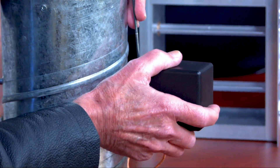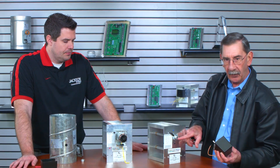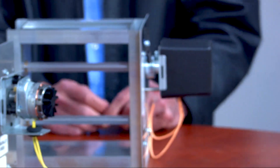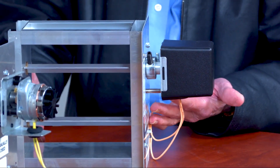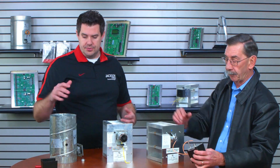On a rectangular damper, you get to keep this neat souvenir — because the collar's already built in. It has a shaft extension that acts as the collar. You just line it up, tighten it down, and replace the actuator. That takes about this long — it's that quick, a lot quicker than ripping the entire thing out of the duct. We get dampers returned where there's nothing wrong with the actual shell of the damper — it's just the motor.